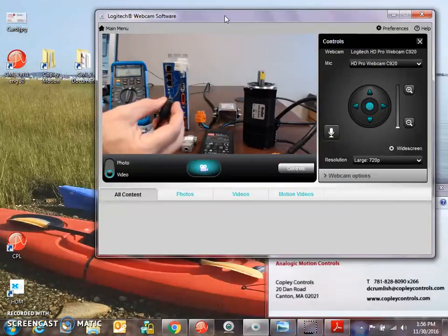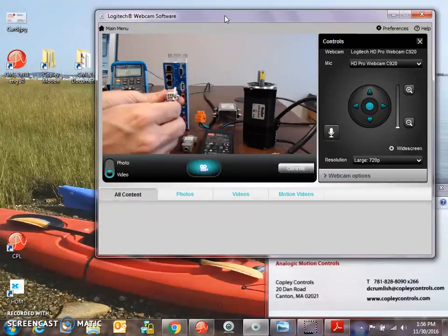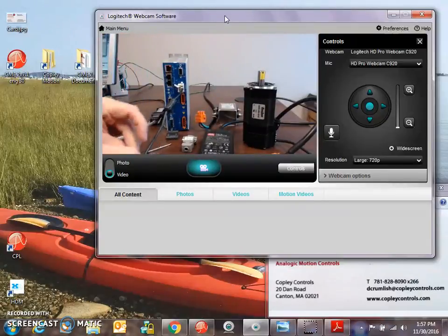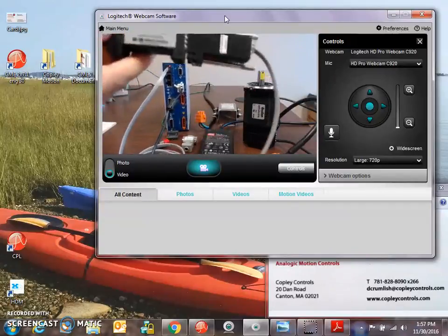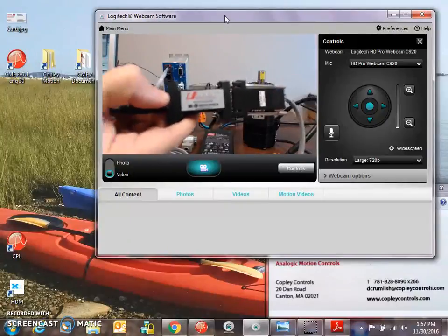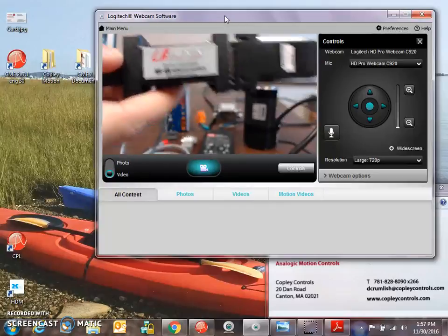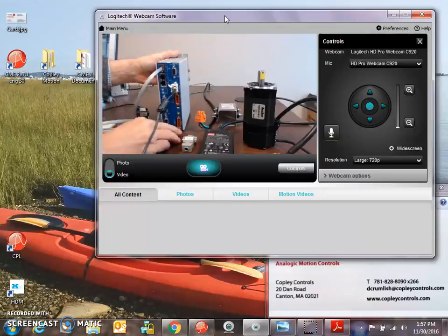So I've got the 24 volts connected here on this little Wago connector, and there's a little tool for opening the socket and putting the wire in. If we wired it up with just 24 volts, we could then communicate to it over RS-232. I'm using a B&B USB to serial adapter, USB9ML2. There it is. So the USB to serial adapter connects to the serial connector kit and allows you to talk to the drive.